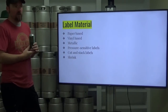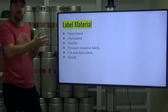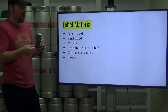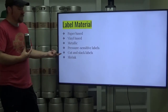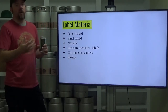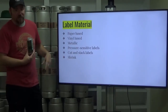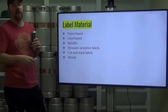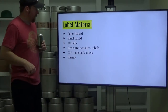Metallic labels are quite thin and are typically not hand applied. Pressure sensitive labels — you put it on, massage it, and the glue really starts to stick. You have a second to take it off and readjust, but once you create pressure it's semi-permanent. Cut and stack labels can be hand applied or used with high-volume machines. Shrink sleeves are an interesting concept: you can put a shrink sleeve over any can — even a previously labeled one — shrink it down, and you've got a newly labeled product without wasting your previously labeled package.